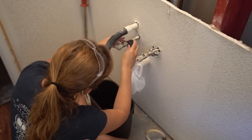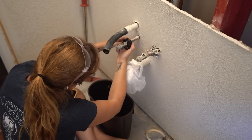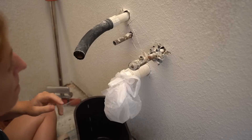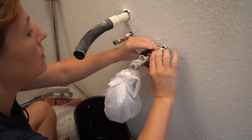Now let's move on to installing the new vanity. You can just rip out the old vanity and put in the new one, but in my situation the plumbing is the original installed in the house, which is 20 years old. So I'm going to take the opportunity to update my plumbing — first, replacing the valves. My fittings were so corroded I simply cut mine off. They make different cutting tools, but I found an ultra compact one that made getting into this tight spot very simple — you latch onto the pipe and keep turning until it breaks all the way through.